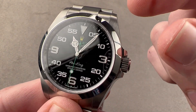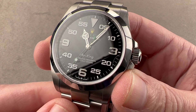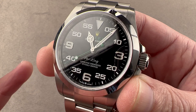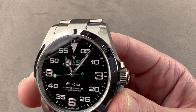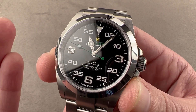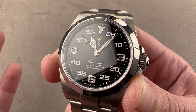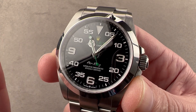Compared to the old movement, it has a winding rotor with a ball bearing rather than a jeweled staff, so it's more shock tolerant, and it features a full balance bridge and a free-sprung balance for additional shock tolerance. The watch movement is certified as a chronometer, but then Rolex takes the certified movement, cases it up, tests it in six positions, so it runs no worse than plus two minus two seconds per 24 hours. That is the basis for the term superlative chronometer. Historically it did not always have a meaning — in the last few years, it has.